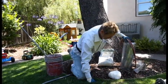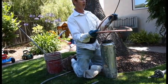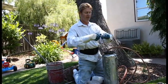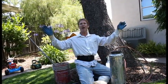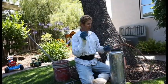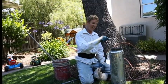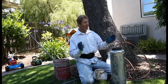Here's the most important part about fog coating: I'm going to clean this out real well, make sure there's no cementitious material in the hose. More importantly, I'm going to put a brand new tip on here. If you get even one little grit of sand, instead of a nice spray you'll get a stream, and that'll just ruin your day. So I've got three new tips. I'm going to screen this with a couple of screens — we cannot get one grit of sand in this. One grit destroys the whole fog.